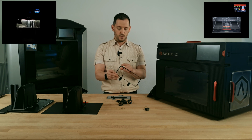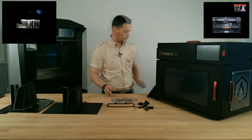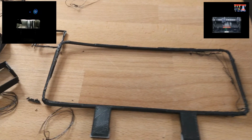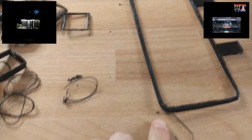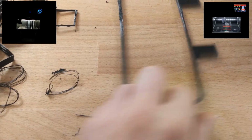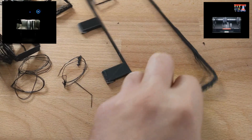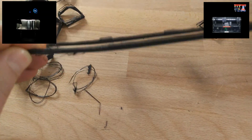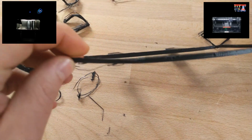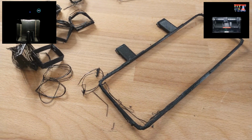and I will show you these with my gimbal. Looking at this, you can see it was printed this way, and it started to lift on these corners here. So bed adhesion was really bad here, these corners, and this actually led to the failed print here, and this is due to not having a heated chamber.